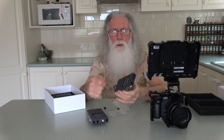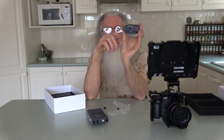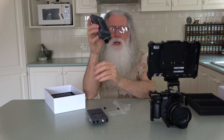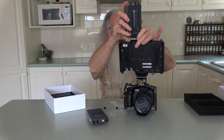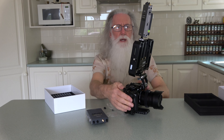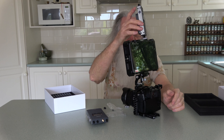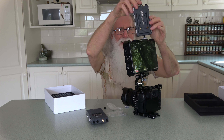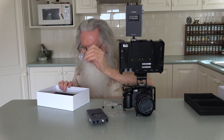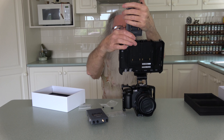If you go back to the video, on the arm there — even here — you tighten your screw and it moves because it's anodized, very smooth. But they have put a rubber insert: they've machined out a thumb nut, put a groove in, and fitted a big rubber washer. Like I mentioned earlier about replacing the bracket with two pieces of nylon — that's how the principle works. Two pieces rub against each other, and when you tighten them they're not moving. It's very difficult to move — a lot more difficult than that bracket.